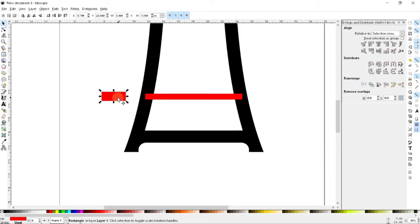So when you are buying plywood, you need to be very, very careful about what the true dimension really is. In America, when you are buying plywood that is labeled as, say, a half an inch, it is almost never actually a half an inch. It is either metric or it's some strange 17/32nd sort of thing. So I cannot urge you enough to get a good set of calipers and measure the true dimension of the plywood that you happen to have bought. Lower quality plywood will even vary from sheet to sheet from the same pile. So it never hurts to be more paranoid about what the true dimension is. Getting this number right is a big difference between a nice tight-fitting joint and a very loose joint that will be weaker and will be less appealing to sit in because it'll wobble.